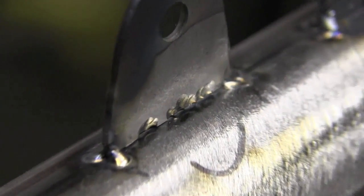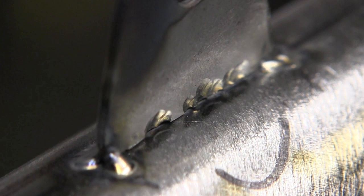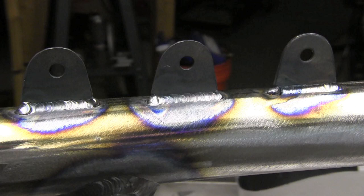This is the second weld. The other side's been welded, so now it doesn't really matter that it's thick to thin because it's tied in on the other side. You can see that even when you weld too hot and melt through, if you've got argon backing on the other side there's no oxidation and you can weld right over top of that with no real issues. Whereas if it melted through without any argon coverage on the back side, you'd have to get a grinder out and dig in and get it all shined up — but this is a way to do it without getting out the grinder.